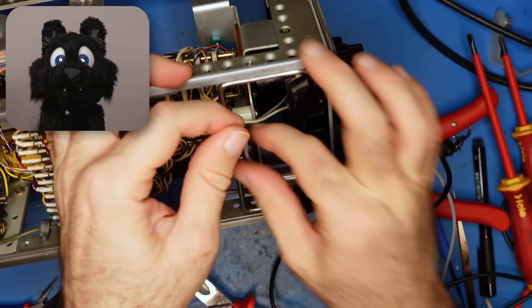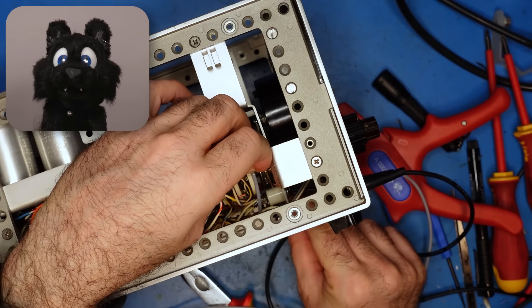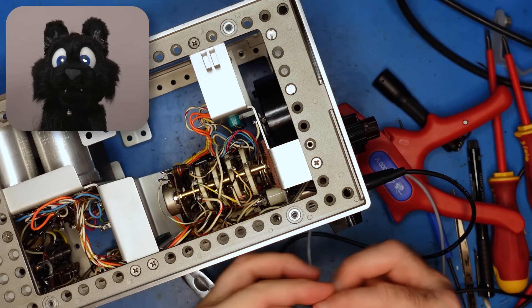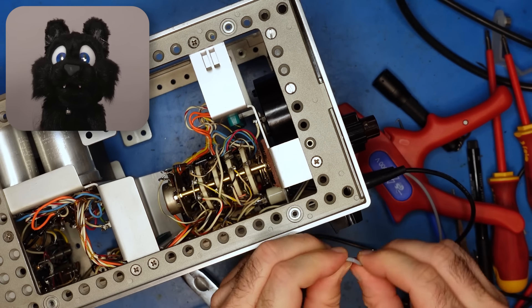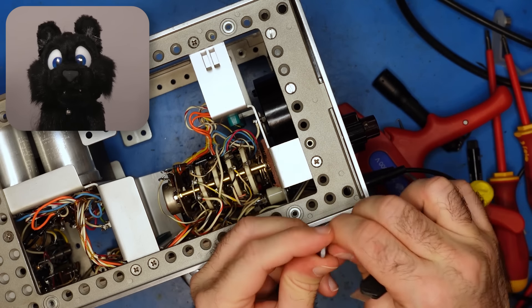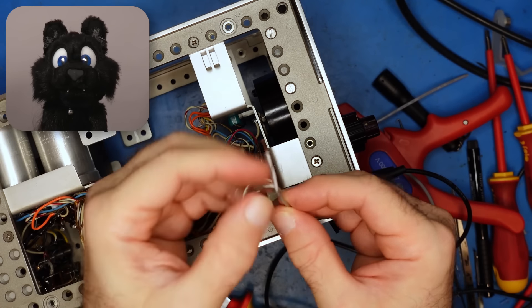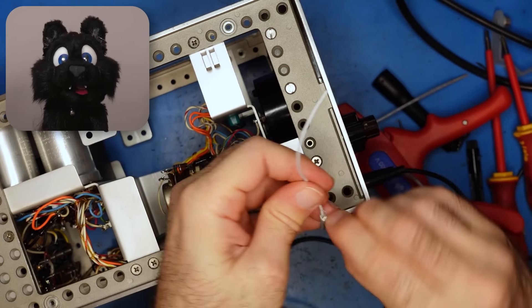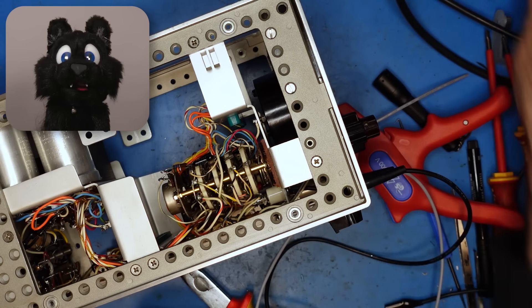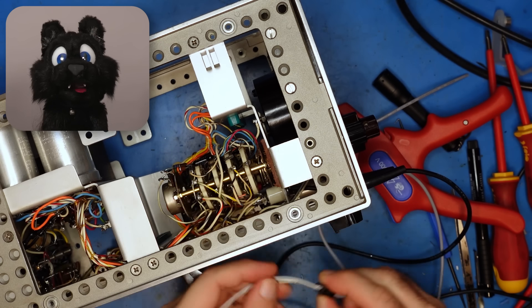Now for the missing wires. I looked all over the place to find good replacements for the shielded DC and ohms wires. Given the high input impedance, I think that shielding isn't optional. The best ones I could find were sold as speaker wires and are rated for 300 volts. This might be a problem if I need to max out the meter at 1500 volts, but I'll cross that bridge when I get there.